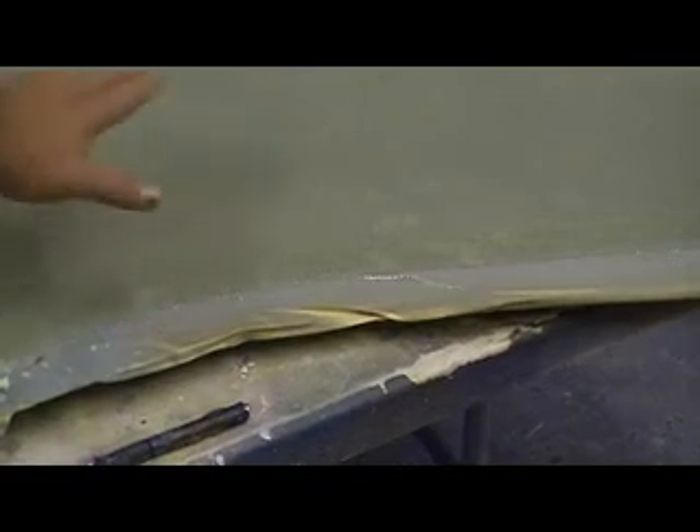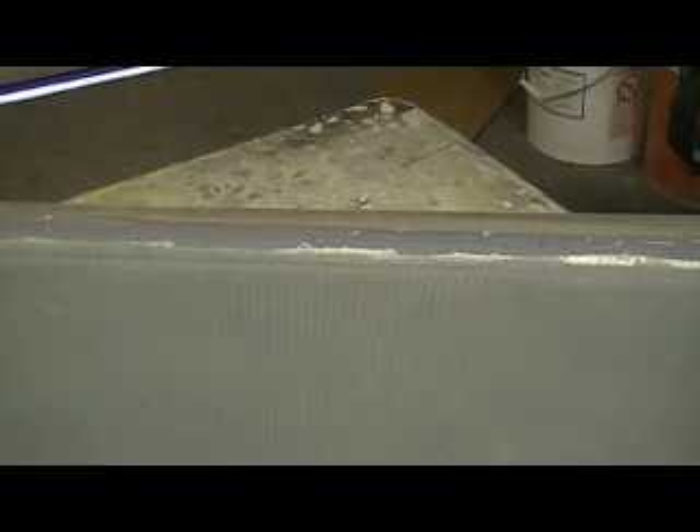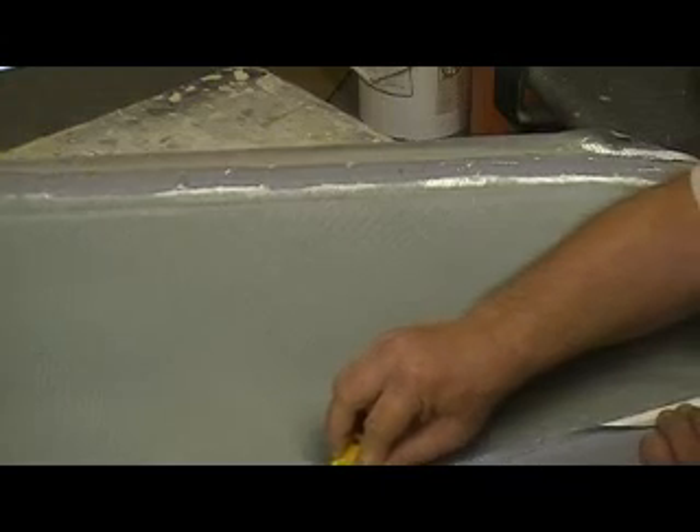See on that back part, remember how I did that? I just butted my glass up to it and then trimmed my big pieces short so I wouldn't have to trim that back edge. Now see what the problem is — when you get all them layers on there and you've got to trim it after it's set up, it's just rough. I've always had my hardest time trimming, but that just made it easy right there. Now they've got a few fibers and a little bit of epoxy on that edge — I'm just going to trim it off, run my razor blade right under the tape.